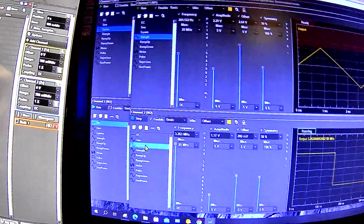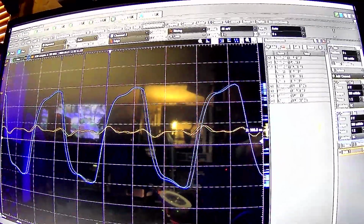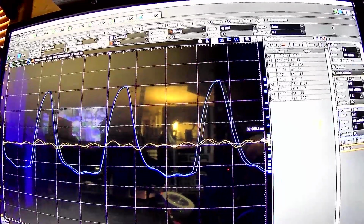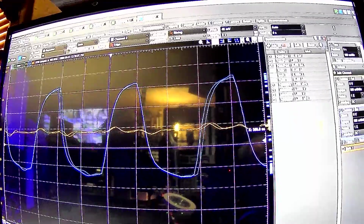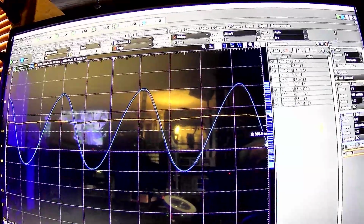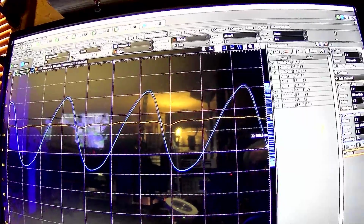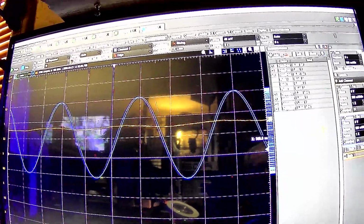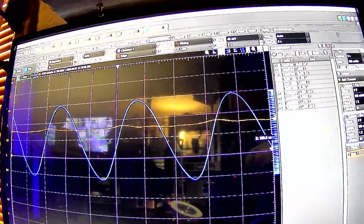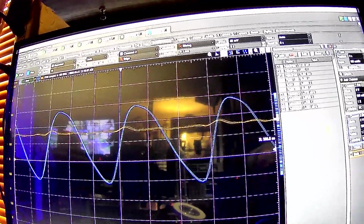Right now I got it set at 3.6 megahertz or so. I just switched waveforms. Let me up it to half a volt. Alright, yeah, steady as a rock. Let me change the symmetry now, back to 30%. Okay. 40%. 65%. Basically, it's still doing its job. Go up to 80%. Back down to 50%. 30%. 15%. I'm changing the symmetry.